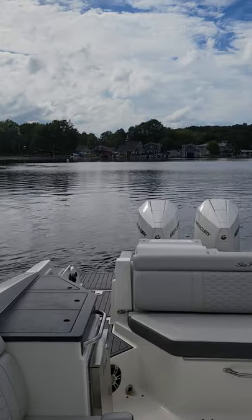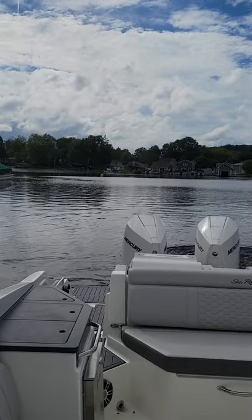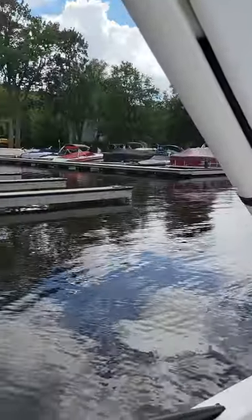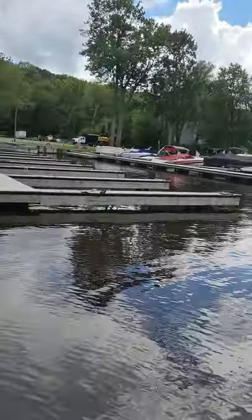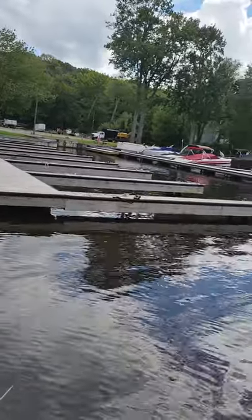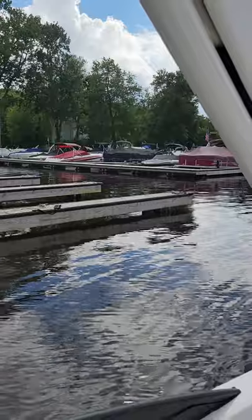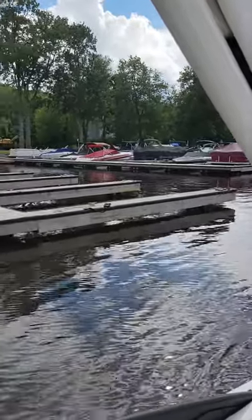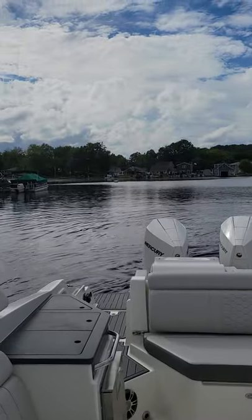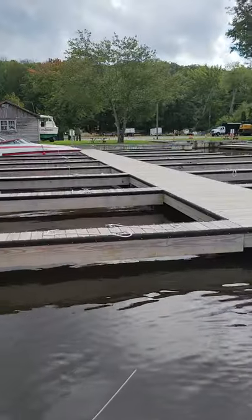So what I'm going to do now is move the joystick hard right and give it a little bit of twist. The engines are doing what they need to do as I approach the dock sideways. The more aggressive I am with the stick, the more throttle the engines have. One's in forward, one's in reverse — they're turned in opposite directions — and we are crab walking right to the dock.